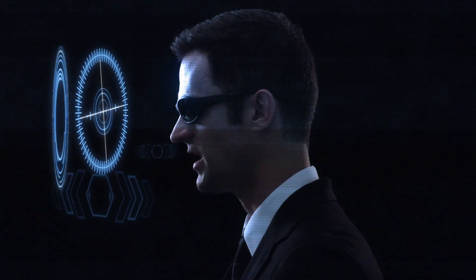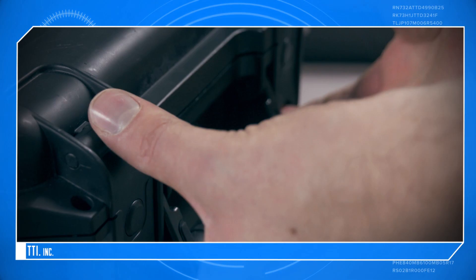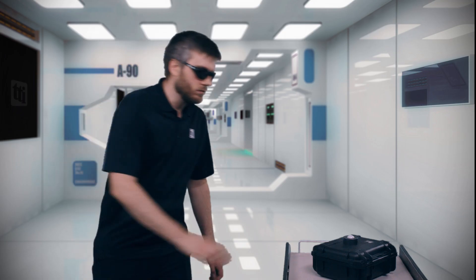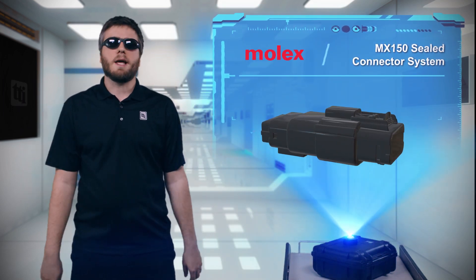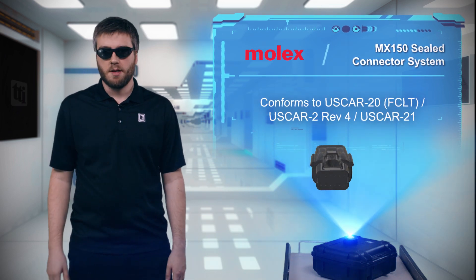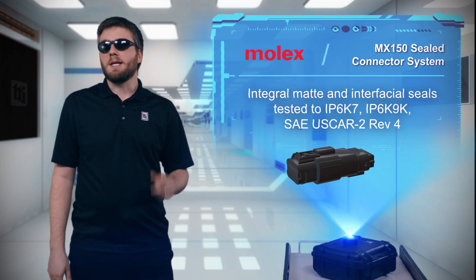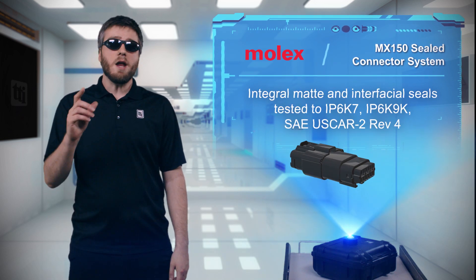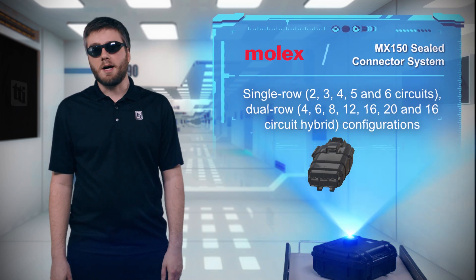What do we have today? While many connectors simply meet U.S. CAR requirements, Molex's MX150 sealed connector system meets up to U.S. CAR 2 class 4 requirements. The MX150 high-performance connectors employ matte and interfacial seals to meet IP6K7 and IP6K9K requirements with wire dress covers, and are tested while submersed in various fluids, with all components shipped preassembled to reduce assembly cost.